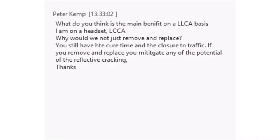Again, I think that leads to the amount of structure you have in the new concrete, how thick it is, versus the bonding, how much bonding do you actually have? And a couple of states are using some different approaches too. I know Minnesota attempts to get to that 3-foot rule, trying to keep away from joints. But again, I think there's more information. Does that help? I hope that answers the question.